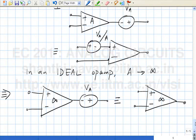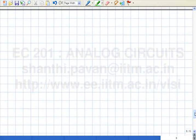If you have an ideal op-amp, then adding any voltage VA in series with the output of the op-amp will do nothing to the potential at this node. Does it make sense? So it turns out that this simple act results in a lot of interesting network properties.